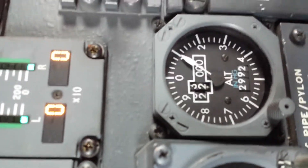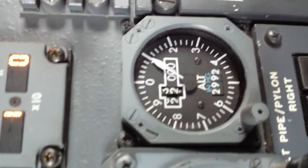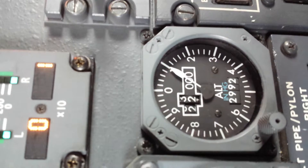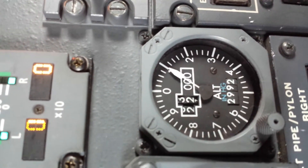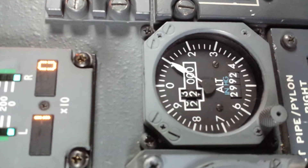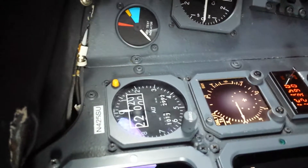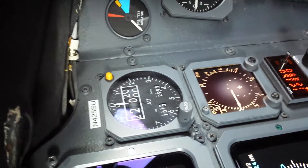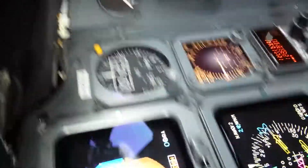Running it so fast has triggered error in the instrument. We don't tap it out until after the five minutes. That instrument probably hasn't changed — yeah, plus five. And where were you at the beginning? Plus five. So typically AirData computers don't suffer from hysteresis. It's just the analog instruments.